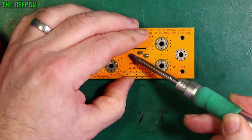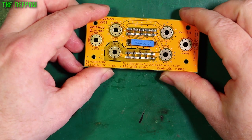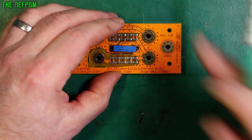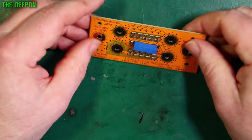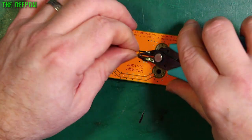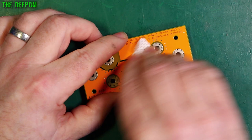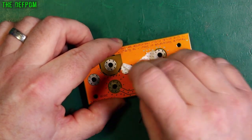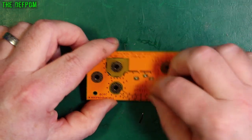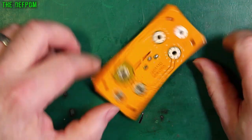Make sure it's definitely seated down nicely. And it's wonky — is that going to be normal? Why is it wonky? Oh well, maybe the footprint's very slightly different or something. Anyway it's in. We'll cut these legs off. I don't want to get any flux residue anyway, because the flux could potentially affect the readings when it's working. Could potentially cause a problem. So there we go — it's built. Well, kind of.